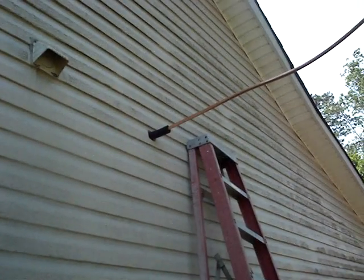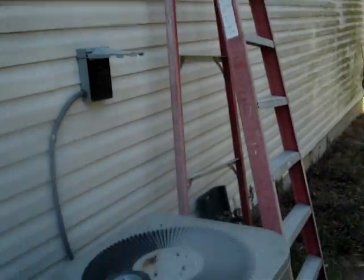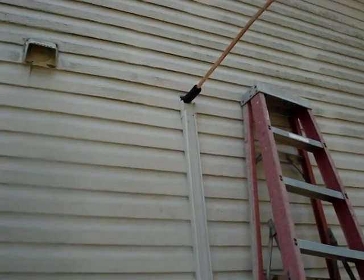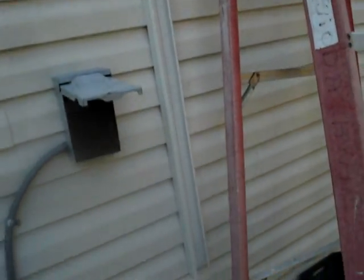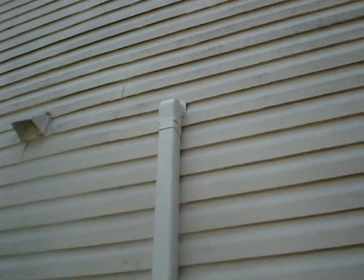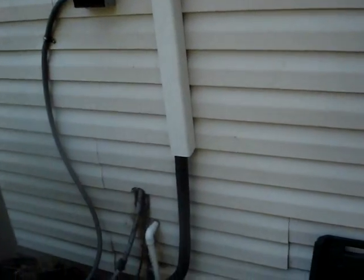I'll be putting a speedy channel — I've got a wall cap to go up there. It'll run down about six and a half feet, seal it, and tie in the condenser. This is the speedy channel — this is the base of it that goes against the wall. I'll fit the pipe in there and then this section will clip onto it as a nice covering. You don't want it all exposed to the elements and looking like an eyesore. This is our speedy channel once it's done — looks real good, dresses it up real nice. Doesn't look awful like those linesets running down the sides of houses with the suction insulation falling off.